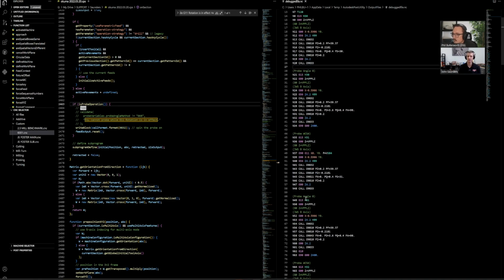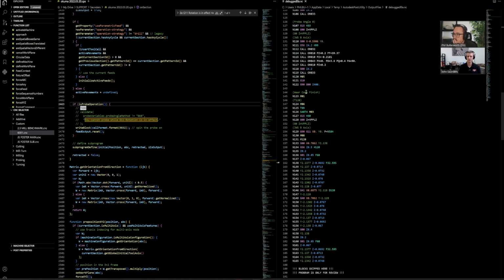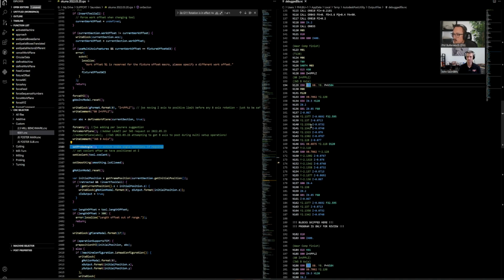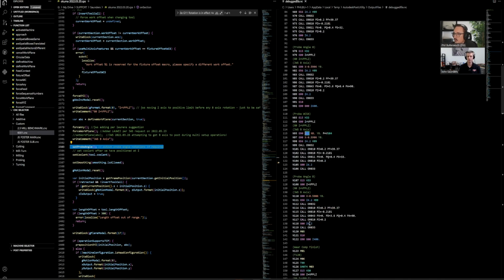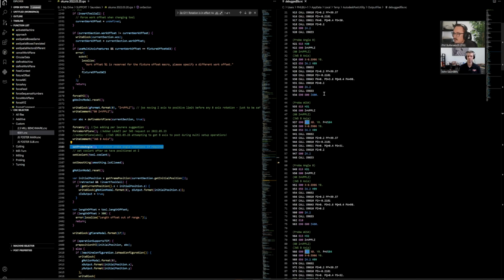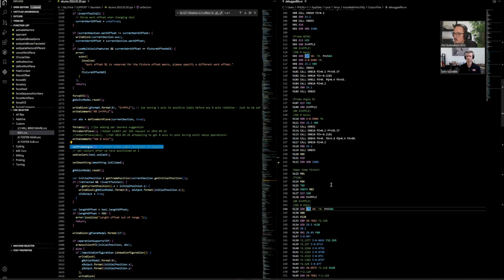Scroll down to find the 2D contours. That's where it should actually... There we go. Okay, yeah, so it's G11. And then, yeah, G10 at the bottom to call it. Okay, so it is posting tool by tool, or path by path kind of thing. It's not going in the exact sequence we want.